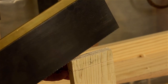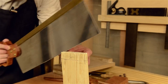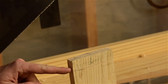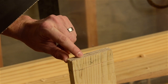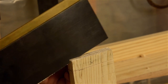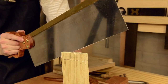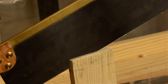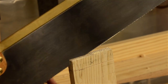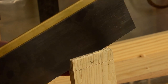To speed things up, I'm going to use this tenon saw — I love this tenon saw. I'm going to set that right in there and loosen my hands on the saw. I'm going to go at an angle, kind of a 45-degree angle. What I want to do is make sure that I'm hitting but not going over that line on both sides, so I'm keeping a constant watch and blowing the sawdust off so I can see where I'm going.